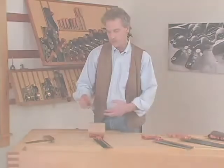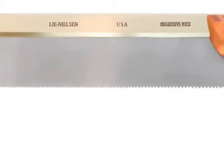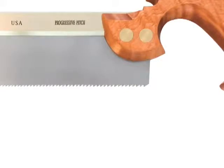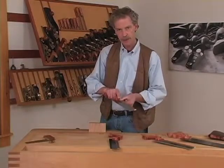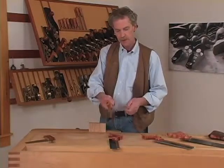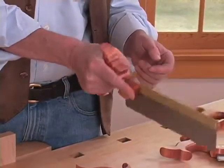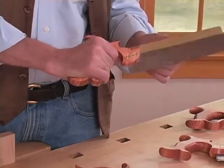This is our progressive pitch dovetail saw, where the teeth start out fine at the tip — about 16 teeth per inch — and end up at about 9 teeth per inch at the handle end. All of our saws have a solid milled brass back that helps stiffen the blade in the cut. They are meant to be held like this in a pistol grip, which helps control the saw in the cut. Saws are not meant to be held like this.